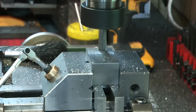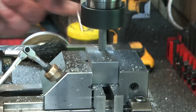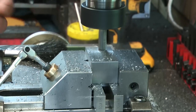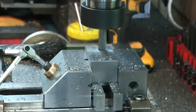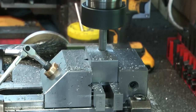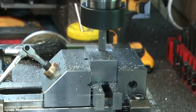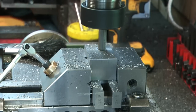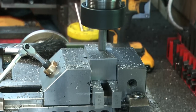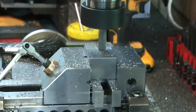When I get that reading I'll open it up off the other side until the tool fits in there nicely, then I'll keep those readings for all of them. It should be roughly 1mm up and 1mm down with a 10mm cutter, plus or minus, and we should be there or thereabouts. I'm going to do the same reading on all of them. I'm not really worried about the 6mm accuracy on the bottom.